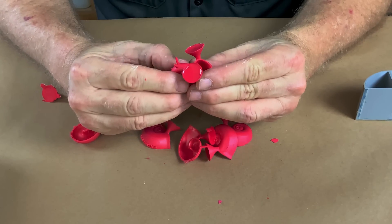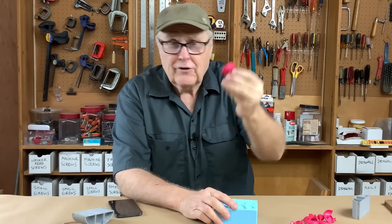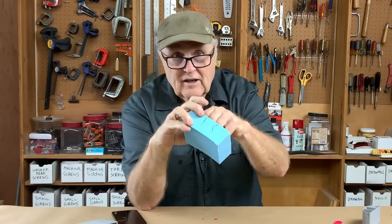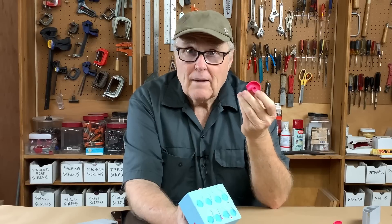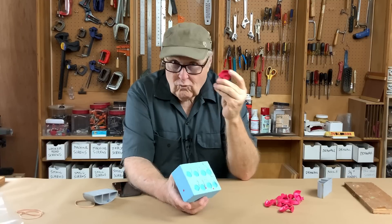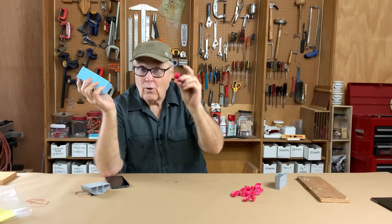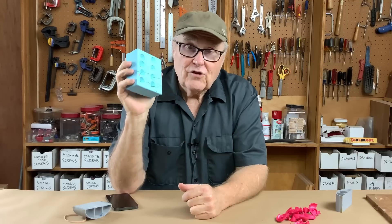Otherwise, I think these are pretty cool and will work out just fine. Some of you may be tempted to point out — he 3D printed these shells, why not just 3D print the shells and skip the casting? My answer is: if you had 10 or 20 of these molds, which would take a couple days to make, 10 molds with 8 cavities each cycled at 2 times an hour gives you 160 parts an hour. You'd need a lot of 3D printers working full-time to match that. It's not just printer time — once printed, you have to remove them from the build plate, clean off all the supports, clean the resin, post-cure the resin. In production, at least in the current state of technology, casting just kicks printing's butt for speed. I don't even know if you can get bioresins for 3D printing. I think in this particular job you're going to make a lot more parts a lot faster using molding than 3D printing.